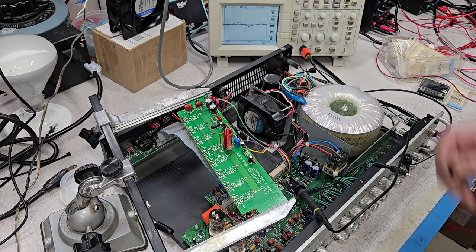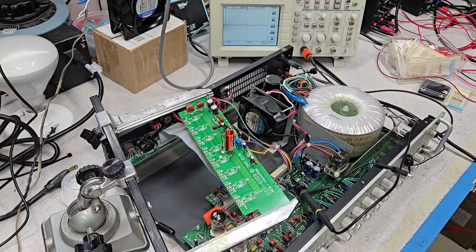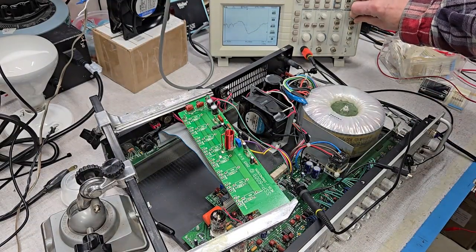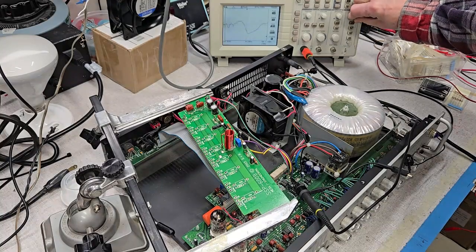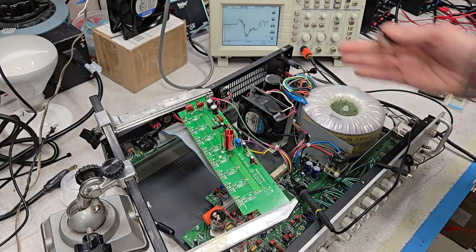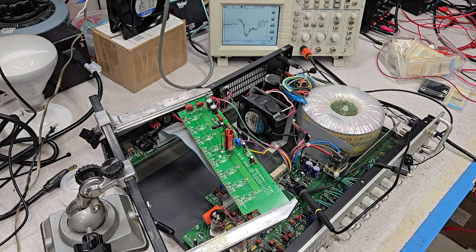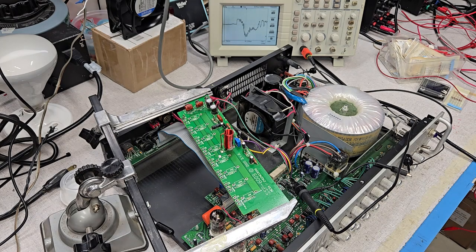What I noticed was it peaks — it gets a very high voltage. You can see there's a root in the waveform. I can put the trigger down here at 150 volts, and it triggers — look at that, there's a full 150 volts right there. So the gates of those FETs have to be protected from those sorts of excursions, which kind of sucks, because it's like clipping the signal with zeners, which doesn't sound very musical to me. I'm pretty sure that's going to make bad sound.